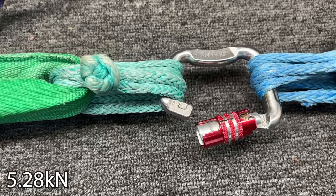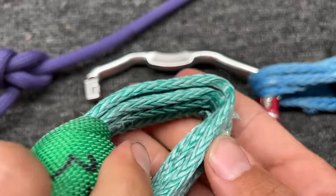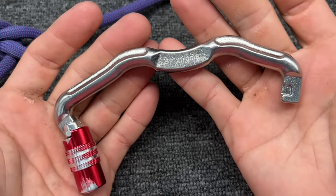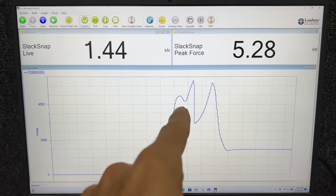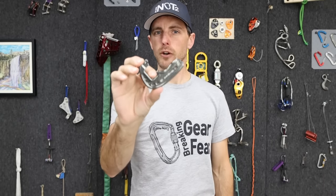What I don't see is damage on these, so I don't think this got pulled out while he was flying around. Let's just open that fully and see what happens. Fun fact: Dyneema holds its shape until you massage it out. But that opened up just like play-doh as long as you have a big hydraulic to pull it. So you can see that was about four kilonewtons before deformation started to happen in here.